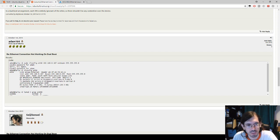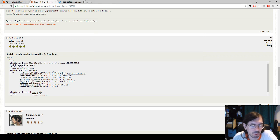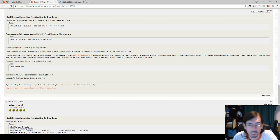I was using a particular Ethernet chip called the Intel I218-V. There are a few different models, but a lot of them use the same driver on Linux, which is the e1000e — there's also a variant without the extra 'e' at the end.